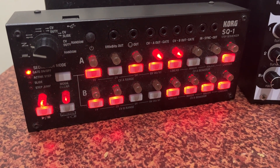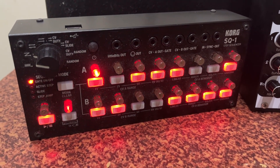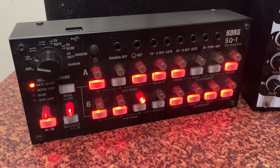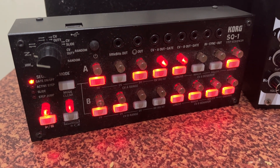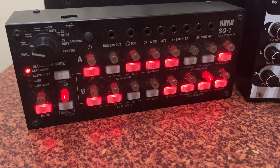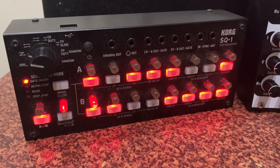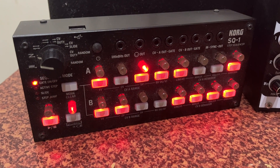This system is designed to work with a Korg SQ-1. The SQ-1 is a standalone battery-powered sequencer, so it is going to provide the primary source for gates that feed into the input of the low-pass gate, and it's also going to provide pitch CV to our oscillators in the Chips so they can play semi-musical sounding notes.